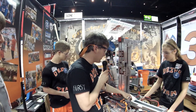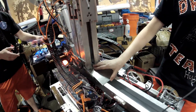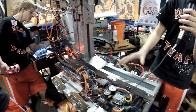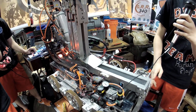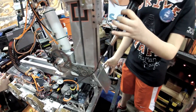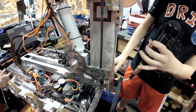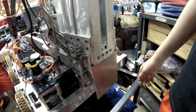Wow, that's a really slick sequence. Katie, can you talk about what this flap does for us? It's just a flap that every time we weight shift forward, it falls out over our bumper. We had a problem where when the weight shifts all the way forward, there's a gap between our bumper and the bar would slide right in. So this simply slides out, covers our bumper, and allows us to pull smoothly over.